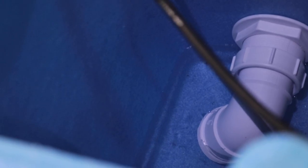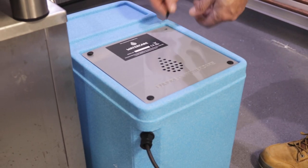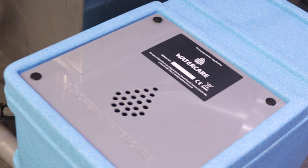Test the pump by pouring water into the pump cabinet, ensuring activation takes place and the water is pumped away. Put the combi pump cover in place and secure using the four black pins provided. Your combi pump is now ready for use.